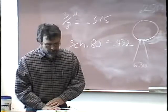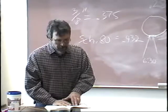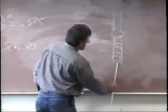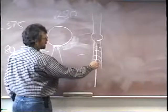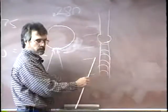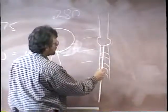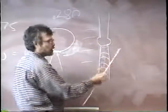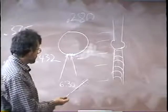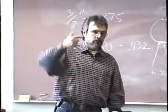Uphill welding the root bead: there is no back-and-forth motion across the pipe joint, only a linear or straight motion along the joint in the direction of welding. You can use a little whip — that's fine — but if you get too large of a keyhole, don't try to chase the size of that keyhole because chasing it will only enlarge it. Whip it out, come back and pause, and that will shut that keyhole down to the size you want. Only use a slight whip, about one and a half to two electrode diameters — it's more of an oscillation than a full-fledged whipping motion. I prefer to use the push as much as possible and only resort to whipping if the keyhole starts to get too large.